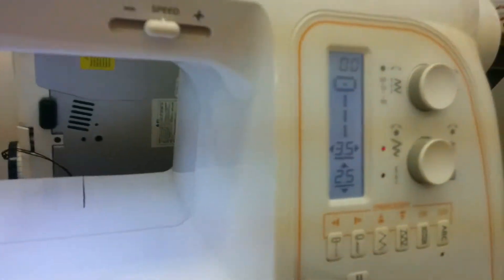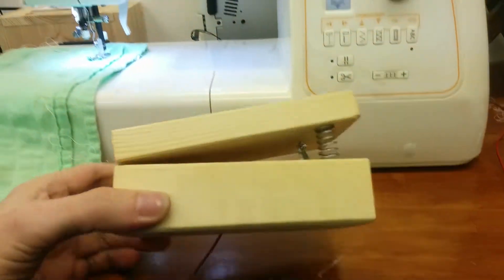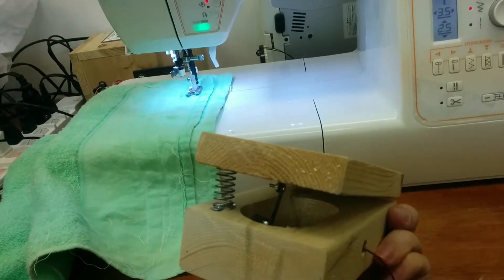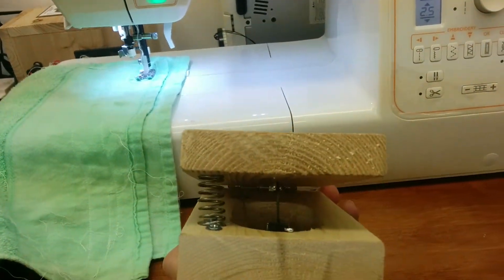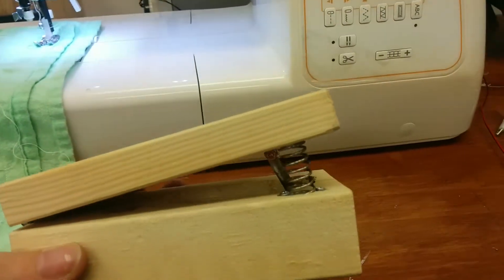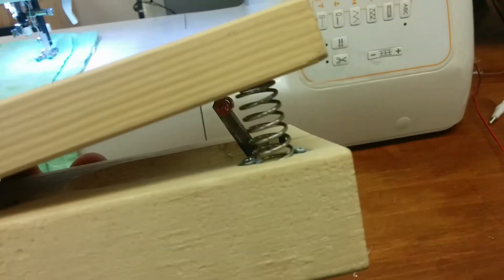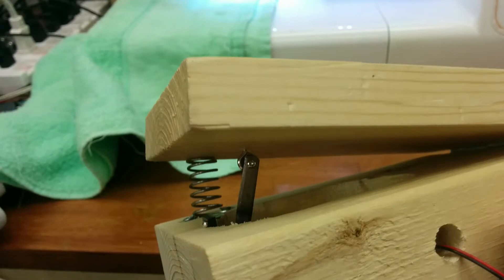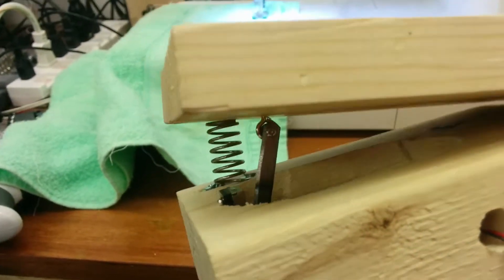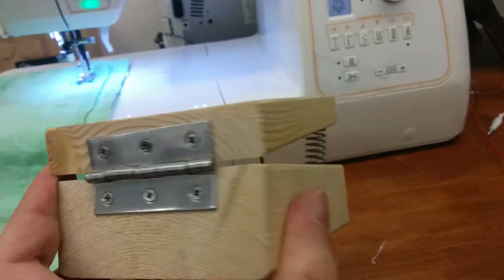But I made a new pedal, which you cannot buy online anywhere. I don't know how you're supposed to get a new pedal if your pedal breaks — they don't seem to sell them anymore. So here's one I made out of a 2x4 and a 1x4, and a spring, and a 20 kohm linear potentiometer that was 50 cents — you can buy those wherever you buy stuff — as well as a flattened nail as my pusher bar, and an eyelet which I used to attach the pusher bar to the top thing.